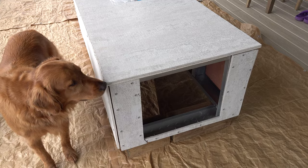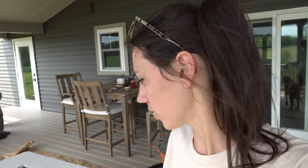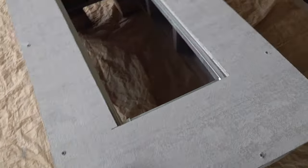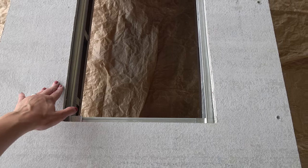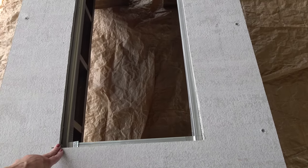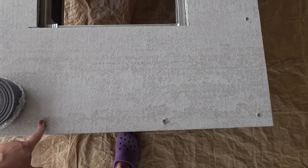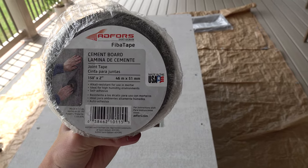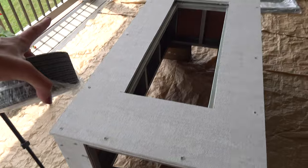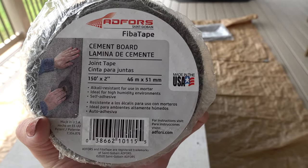This hole here I left for the door so we can hide the propane tank right inside. I've gotten the hole for the fire plate cut out — I measured the center of that hole, and rather than line it up perfectly with the hole already in the framework, I wanted that exterior lip of the pan to sit on the inside of the cement board so I had a border there. I measured the actual fire pan, drew lines, and used the circular saw to cut that out, then attached it with cement board screws. The next step is to use this cement board joint tape and go around every joint to secure it for another layer of reinforcement.